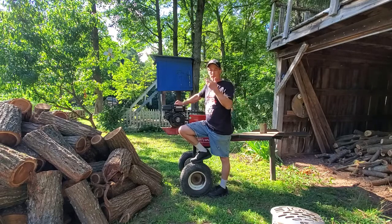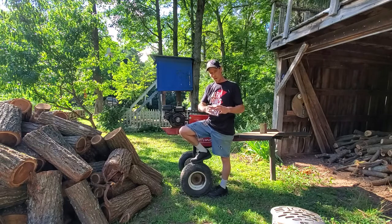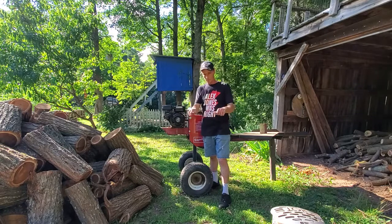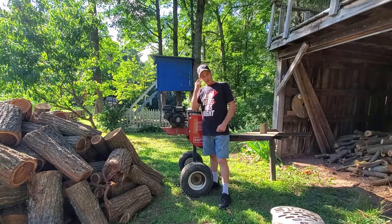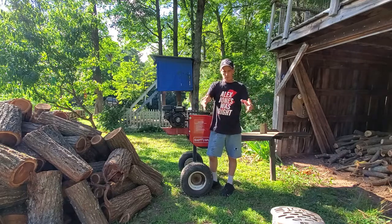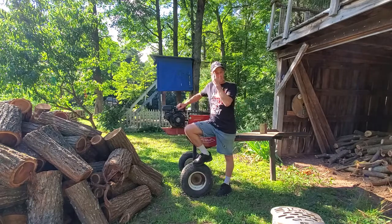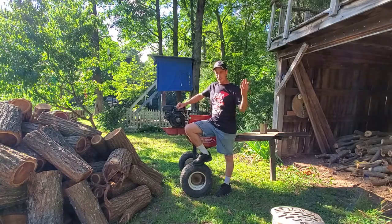you don't have to wait for your fire to go out to clean it out. It's got a metal square plug in the floor of the wood burner. You get it out with a poker. Then you rake the majority of your ash into this hole, which goes into a drawer that's underneath. And then you put the plug back, and all the coals that you elected to keep, you just rake them to the center and add wood, and you never have to let your fire go down. And all those coals stay inside that drawer and turn into ash, and the off gas of that material that's in that drawer is getting sucked back into the fireplace.